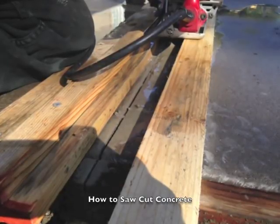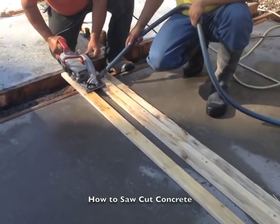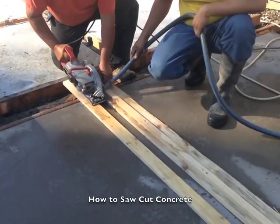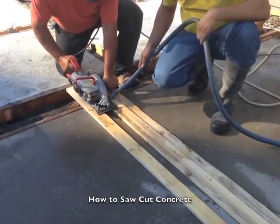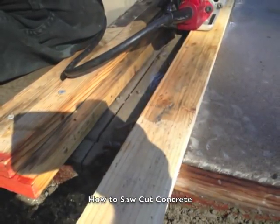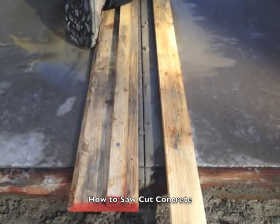Use ear protection and eye protection. Wet the surface of the concrete where you will begin the edge of the cut. Have the worker with the hose regulate the water to a fine spray and direct it on the blade where it contacts the concrete. Start the blade and slowly cut the concrete, with the hose following the blade to keep it cool. Assure the blade is following the cut line and keep the blade guide snug against the jig rail. Because the edges of the concrete are so sharp, it is important that you don't twist the blade at all — if you do, the blade is likely to rip the top edge of the joint off, so make sure you keep the blade very straight up and down.